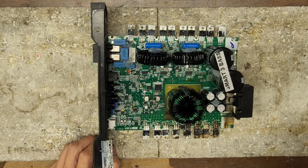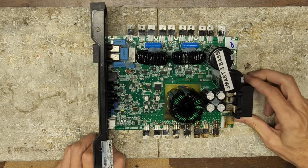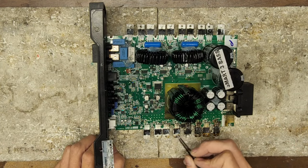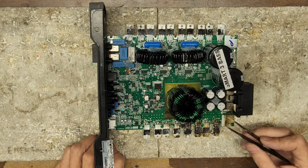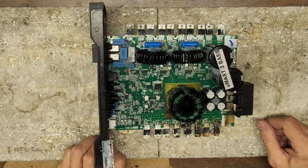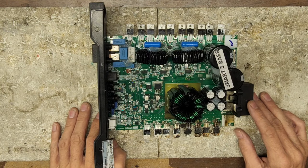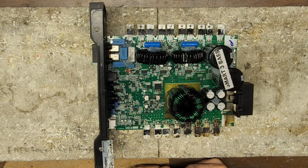So is it a driver failure? Most likely it's a driver failure — driven hard. Everyone runs these amps pretty hard, a lot of current goes through these. Eventually, if something overheats, it's going to fail. Once one transistor fails, they all kind of go off in line because there's just a short — drain to source, it's just a short across your batteries. That is the typical failure of a power supply. I'm going to get these power supply transistors out and get this board cleaned up so I can see what I'm working with.